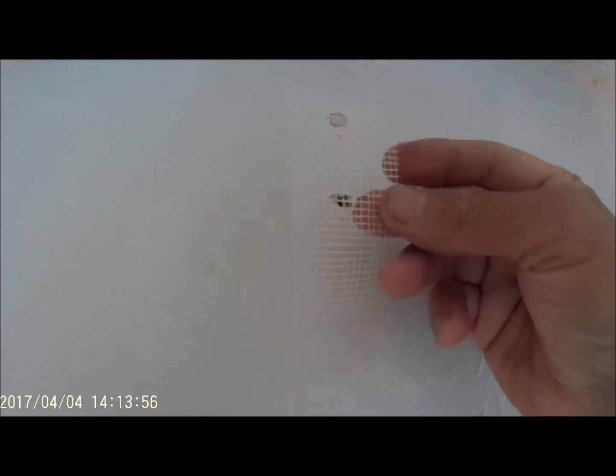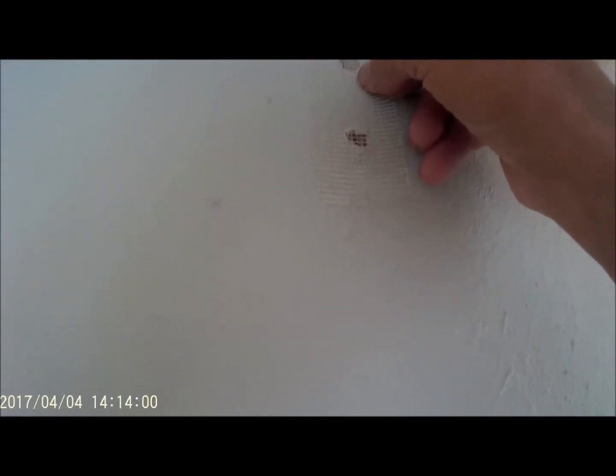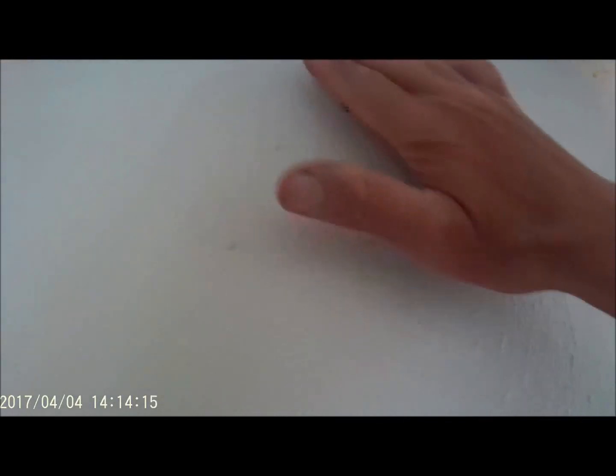We're going to take a piece of this mesh. It's tape for joints, and it's that fiber material, much nicer because it goes on thinner. It also goes on without a first application, so this is almost trying to skip a step. And in a patch job, getting it ready, we don't have a whole lot of time to come back 2 or 3 days in a row, if you will, so we're coming up with a fairly quick solution.